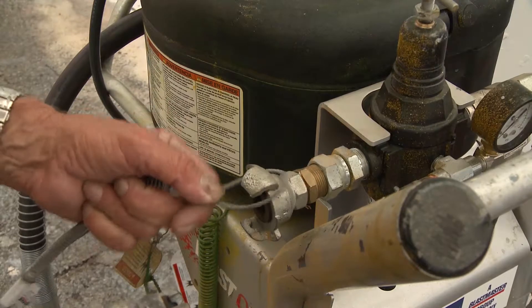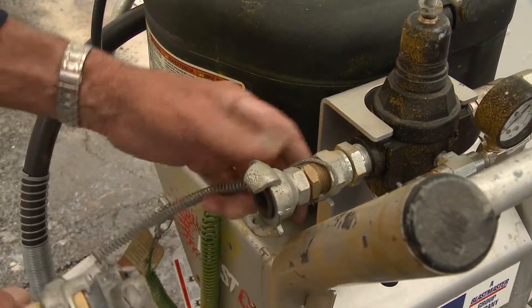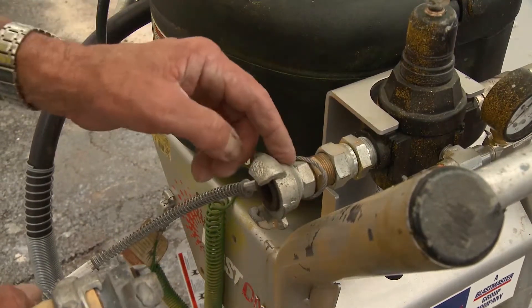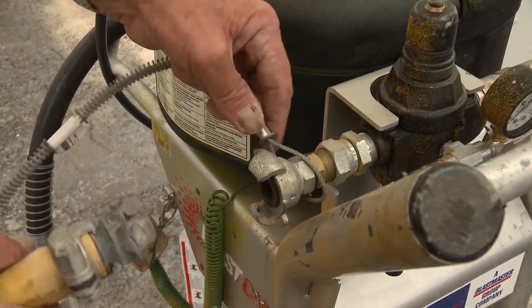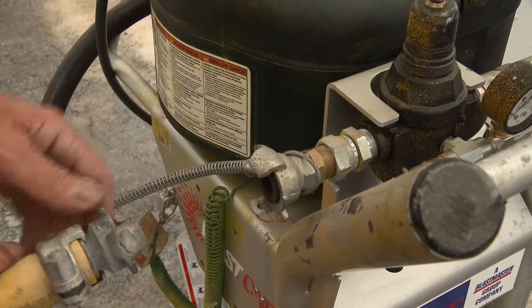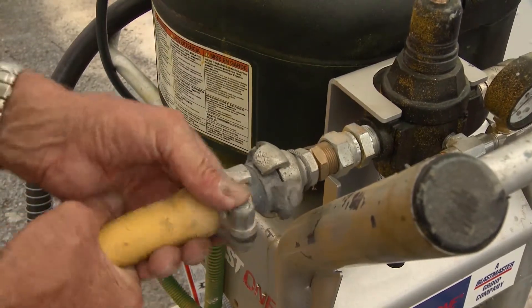The whip check slides over the A-type coupling gasket and is backed into the stem of the fitting itself, so that the retainer must come up and slide forward. The spring does this for you to hold it in place. Then we couple the unit up like so.